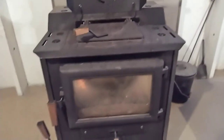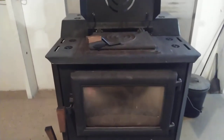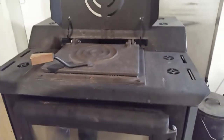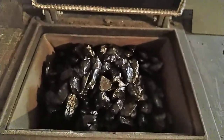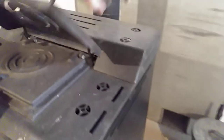I buy the coal in bulk — there's a place half an hour away. I get a ton in a truck bed and bought about fifty buckets from Home Depot with lids. If you do the math it pays for itself versus the price of bag coal. That place offers oiling — I got it oiled this past time. They have full rate at one gallon per ton, half rate at half gallon per ton to keep the dust down. When that oil burns off, you can hear it sizzling and it's shiny. That puts off a little smell so I always close this door first and latch it.